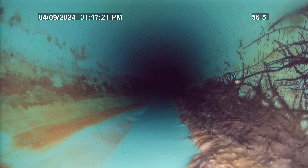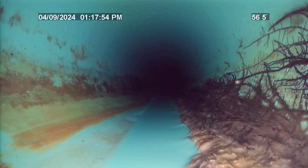Right here at 56 feet is a failed joint in the SDR 35 PVC. A properly plumbed and glued PVC sewer lateral must have no root intrusion in the line whatsoever. So again, right here we have a failed joint at approximately 56 feet from entry point in the SDR 35 PVC, in need of repair. Going to go ahead and get this spot located now, so the video will be paused for a moment while we do that.